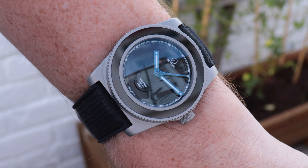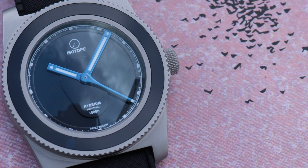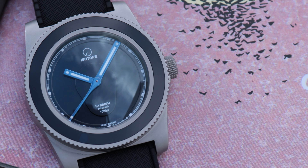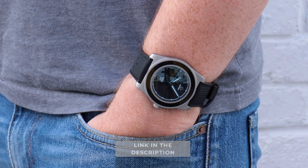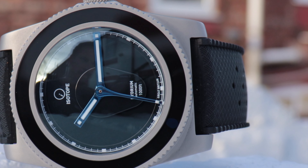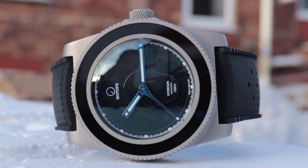The movement is one I've not come across before — it's a Landeron 24. Either way, it's a clone of the ETA 2824 and it's running pretty well here. It's a 40-hour power reserve with hacking and hand winding — all the usuals. It's Swiss Made, although there is some debate about that on Caliber Corner, which I'll leave a link to below. Isotope put Great Britain at six o'clock, which is a nice little nod to their proud albeit short history.